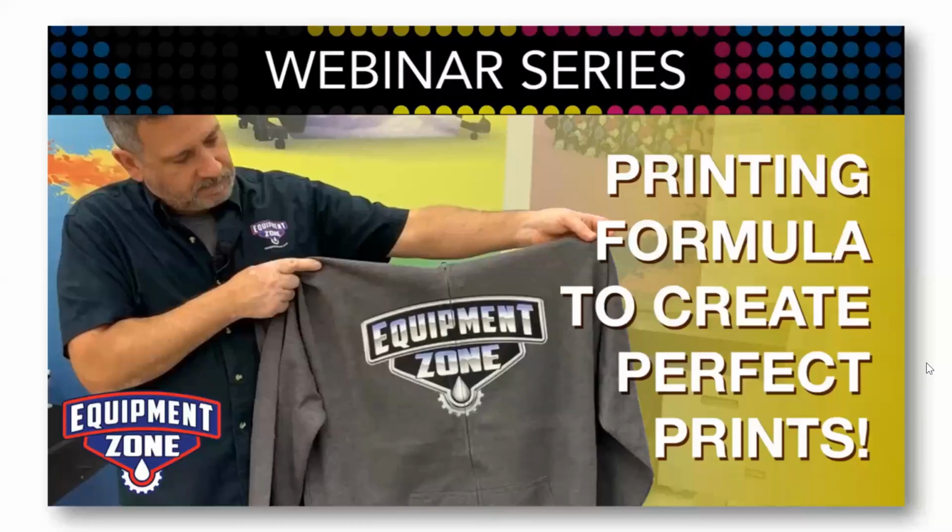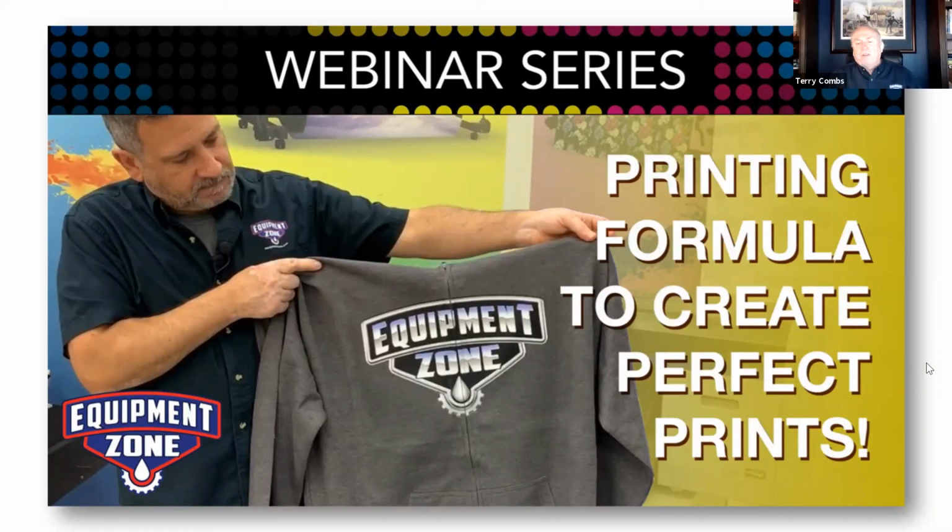And I did post in the chat the All We Do Is or Just Hoods brand, which funny enough is a zippered hoodie. Did you guys see that when I popped it up there? That's why I did that, so that we could see the hoodie. That is the All We Do Is brand or Just Hoods brand. Well, and that's also printed on our exclusive hoodie platen that is only available at Equipment Zone. The reason we could get that great print across that zipper is because there's a little slot that lifts out of that platen so that the zipper can fall down in it and get a really, really good print with fabric in the middle and the zipper in the middle.